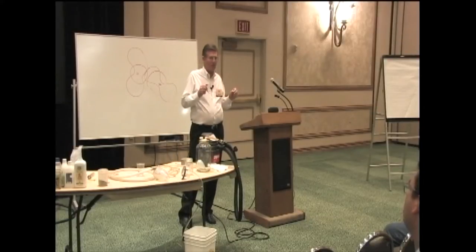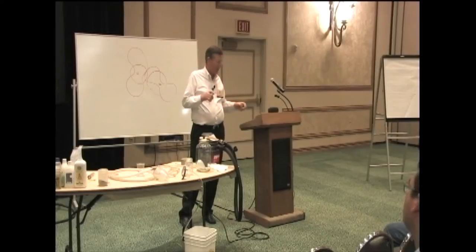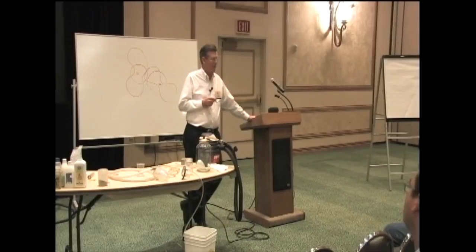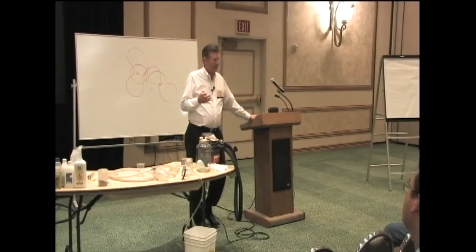The 15 and 18 inch blowers have vacuum breakers — vacuum relief couple valves. It's basically a valve that once it reaches 15 or 18 inches of mercury, it sucks a spring up with a valve seat on it and lets air come in. That air is not cooling air — it's intended so you can continue to run under continuous duty. It is basically a warning that if you're in a low airflow situation you're not getting the proper amount of air through the blower, and you need to find out why.